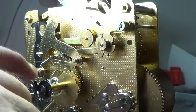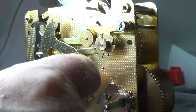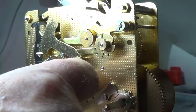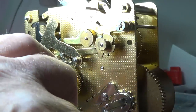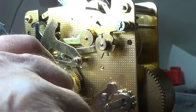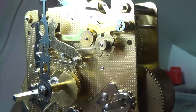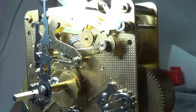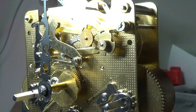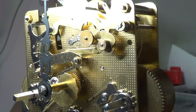just the minute hand has to be put on in relation to the highest cam, the hour cam, because that's where everything gets corrected, right here at the hour. When that high cam lifts everything, then it catches up to where it ought to be. I know that's kind of a cumbersome explanation, but that's the way the puppy works.